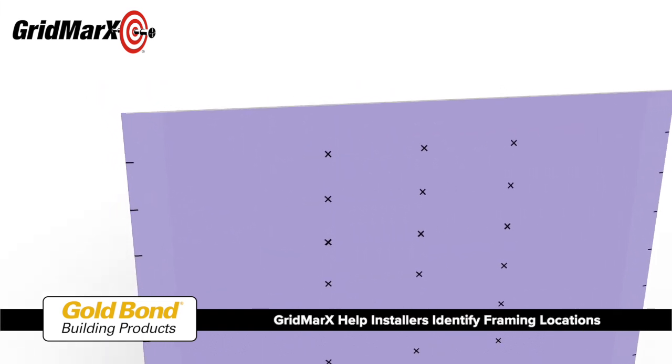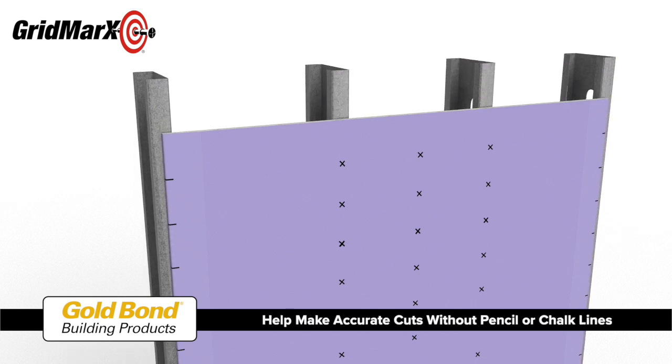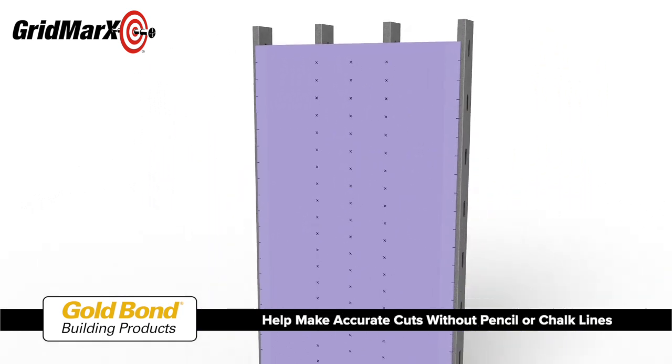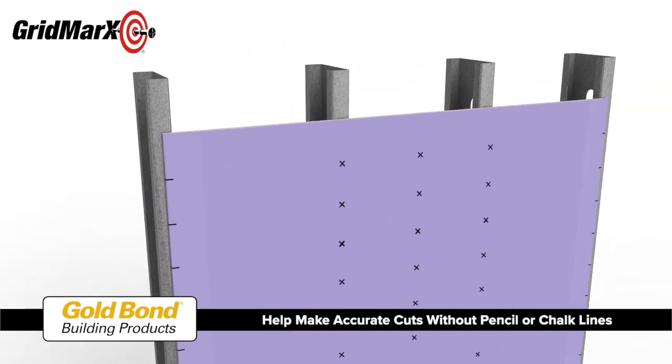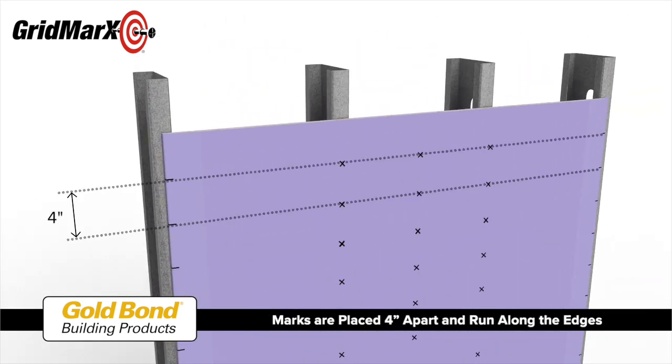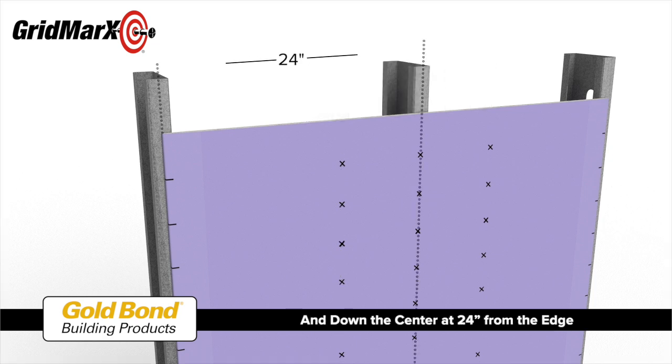Grid marks act as a guide to help installers identify framing locations and make accurate cuts without having to pencil in or snap chalk lines. They run along the board lengthwise every 4 inches along both edges, at 16 inches from each edge, and down the center, 24 inches from each edge.